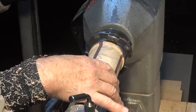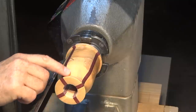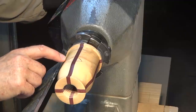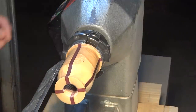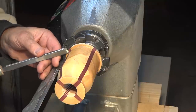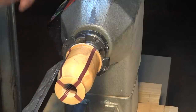I'm quite pleased with it so far. I've sanded it down to 400, put on a coat of sanding sealer, sanded it to 600 grit to get rid of the raised grain, then put a couple coats of Minwax wipe-on poly on here. I'm really pleased with the way the grain seems to follow all the way around. I'm going to part this off using my skew chisel to score a line at the end, then use the parting tool on the far side of that.